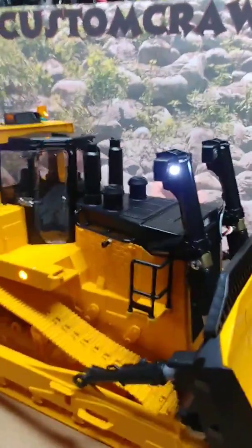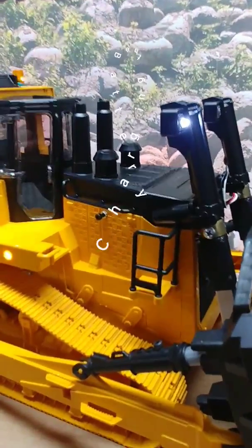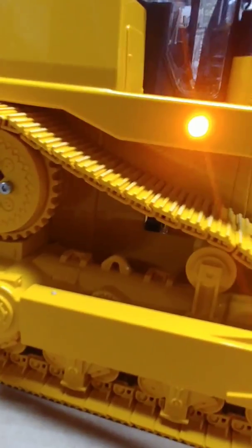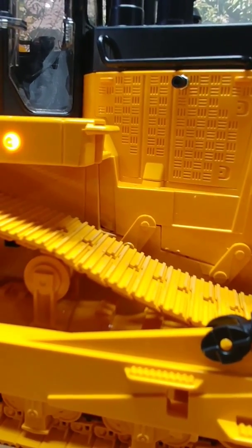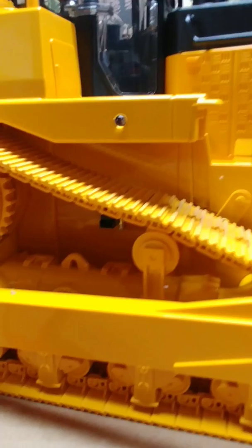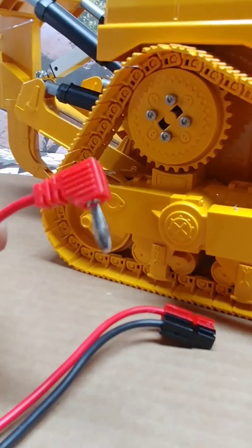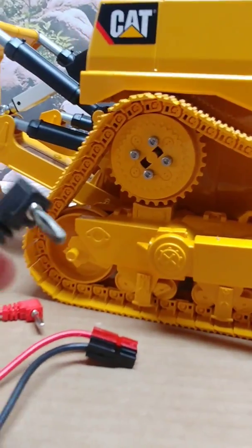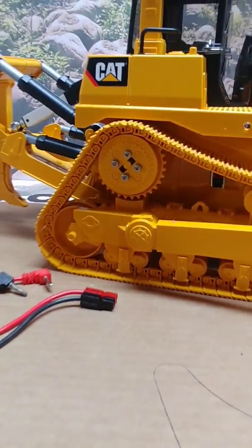When your battery goes dead, you charge the unit. There is a charging port right up underneath the track here — you simply plug in your charging plug to that. It's got the power pole connectors. I'm not going to plug it in right now because the power is on to the unit. As soon as you plug that in, if that battery has charge and your ends are not in the charger, they are live. So when you're going to plug it in, make sure that you are plugged into the charger first.